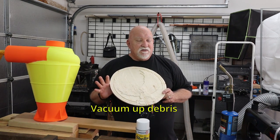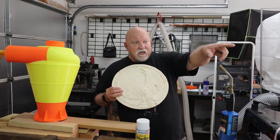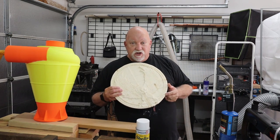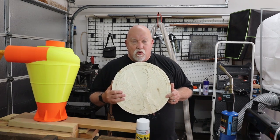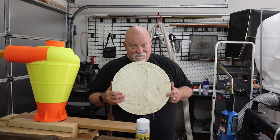Now, when I'm in the house at my other computer, I have a PC out here in the garage in my shop that I pull up StreamYard. I set up a camera looking at my job. So when I'm in the house on my other computer, on one of my monitors, I can monitor the job, because you never ever want to leave CNC work or any kind of machinery running on its own unattended. And we'll get to why here in just a minute.